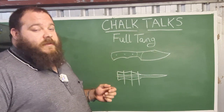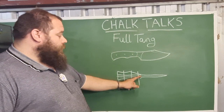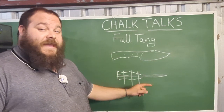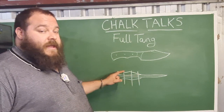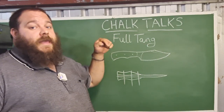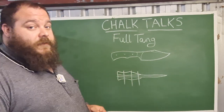There are some downsides to having a full tang. If you're using carbon steels, hands are going to be in contact with the tang piece, and while the owner may oil the blade they may not oil the tang sides, which means you'll end up with rust and pitting happening along the tang. And if you haven't got a proper glue joint or seal between your scale material and your tang, moisture from the hands can seep down between those two and rust the tang from the inside, which is really bad for a knife.